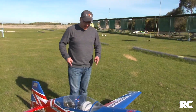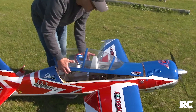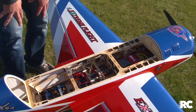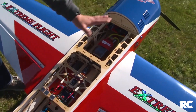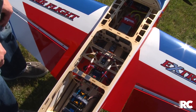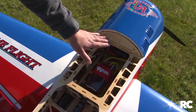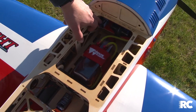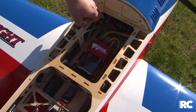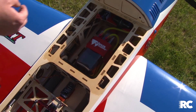Time to have a look at what's under the hood electronics-wise — pulling the big canopy off. Starting up front, the builder is a clean freak; it's an amazingly neat installation. He's running LiPo batteries for the ignition using the PowerBox Spark Switch, which regulates power to the ignition and also acts as an engine cut-off.